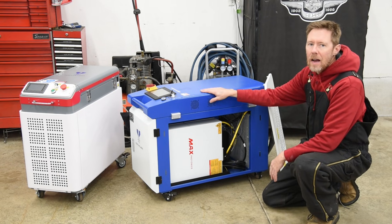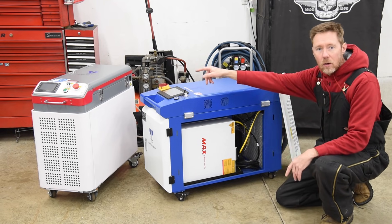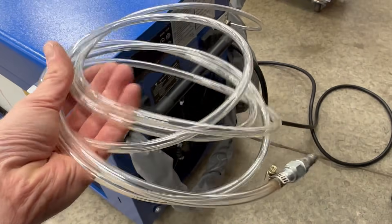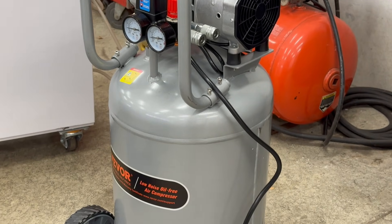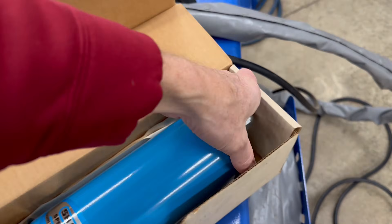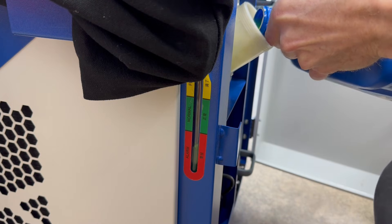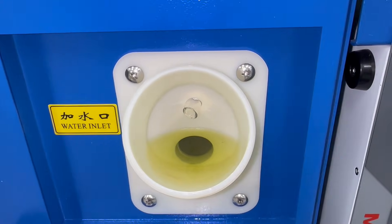Because this FLC 2000 is so powerful, it's liquid cooled instead of air cooled like the FLC 200. It does still require clean, dry, compressed air. You don't need a large compressor — I use a 13 gallon 2 horsepower compressor and it does the job. But you will need an inline filter to separate moisture from the air. Being liquid cooled, it requires distilled water or an automotive grade coolant if it's stored in temperatures that can get below freezing.